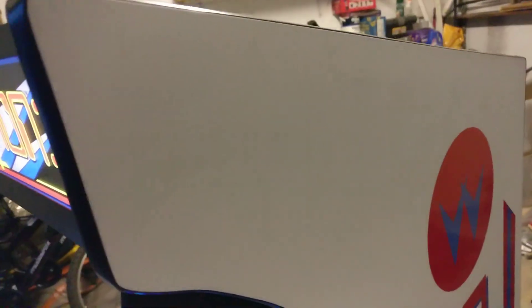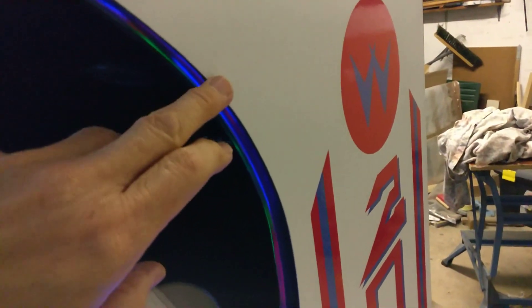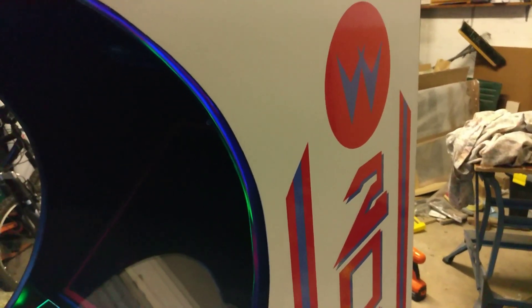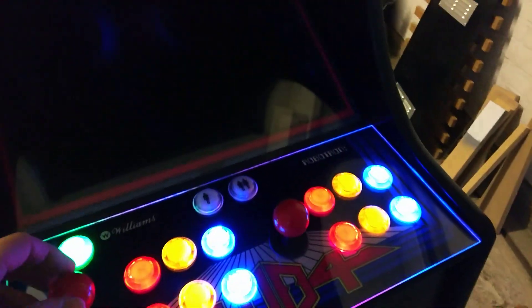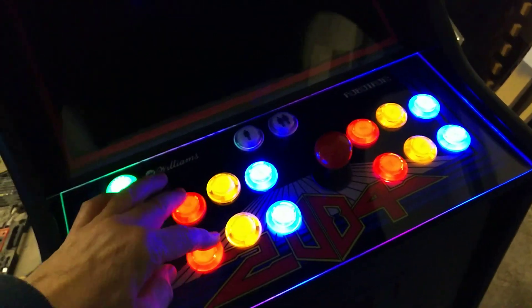The machine is heavy — it's 18mm MDF all round with battening, and there's about 16 coats of paint on it because spray painting was one of the hardest things I've ever done. The sides are actually rollered — you can't quite see the texture, but it's a very light gray. A friend online who's also an arcade machine builder, Neil, recommended using a roller and it does indeed work very well.